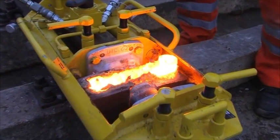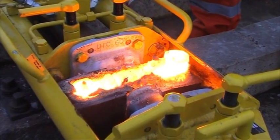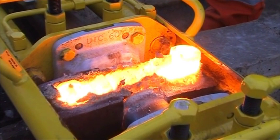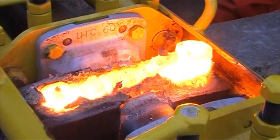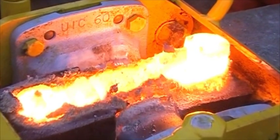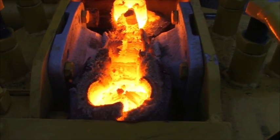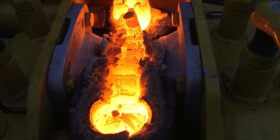If the mold head is removed early, the welding material is colored white or light yellow. Start the trimming when a darkening by oxide skin with blisters rises up. If the mold head is removed later, the welding material is already colored yellow. Then immediately start the trimming. The given waiting times after pouring to the mold head removal and to the beginning of trimming may be only rough recommendations.